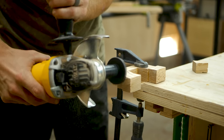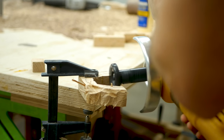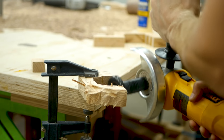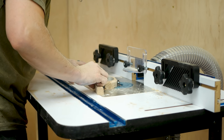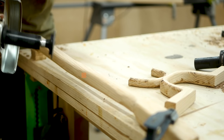To make the stirrups for the feet, I switched back to the mini turbo to get into the tighter spaces, and this was much of the same — carving down the piece to get it to a nice rounded shape. Once I did, I took it over to the router table to give it a quarter inch round over on each side, and this was a more safe and delicate solution than trying to give the piece a perfectly rounded profile using just the turbo plane.